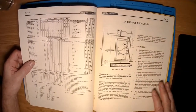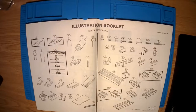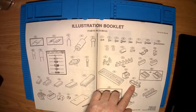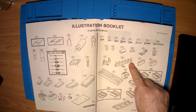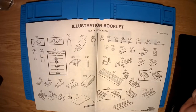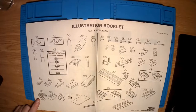There's the final assembly section where we actually put the thing together. We've got some programs to teach you how to do a little bit of programming and exercise this thing. We've also got a listing of the contents of the ROM, a memory map, the 6800 instruction set, how to drive the LEDs, and a debugging guide. In addition we have an illustration booklet which includes pictorials describing all the parts using references like A1, A2, G5, G11, etc. This is the case for the UA309K missing power regulator. We're also missing a six-way solder lug terminal block — I've sourced some eight-way ones to cut down. The triple-pole double-throw switch, element E1, is the one I'm still having trouble sourcing.